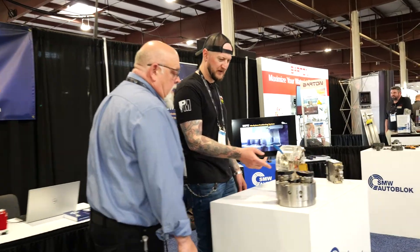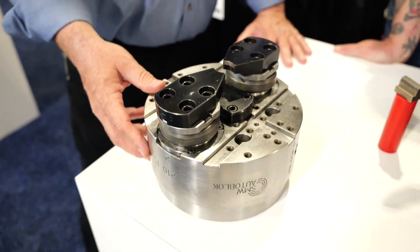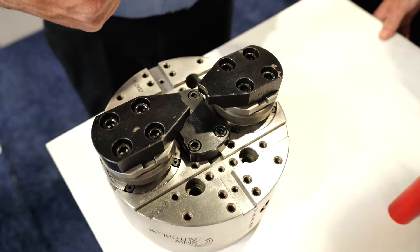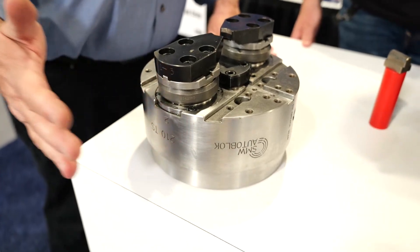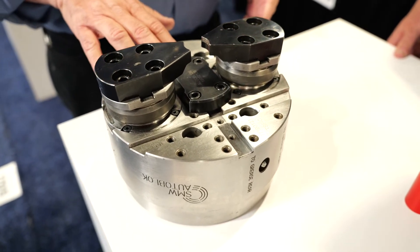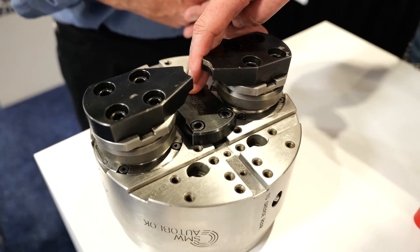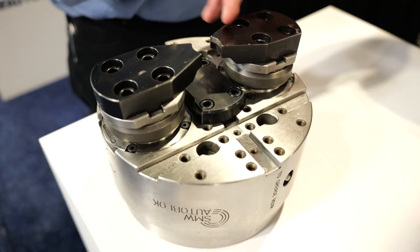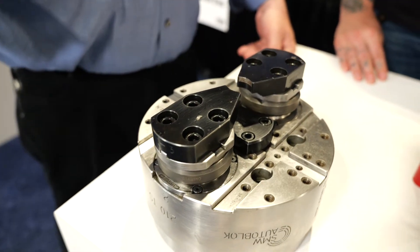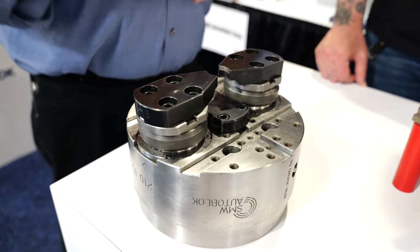What am I looking at that's on a chuck like this? This is a two-jaw TS chuck. We sell them in two-jaw, three-jaw, and also six-jaw. This is a pull-down chuck — it was developed for a special part that had to be pulled down against the datum. Both these jaws rock in and pull down, and at the last minute pull it against the datum. This is for high production, automotive, shaft work, making air conditioner parts — repetitive work all day long in the same machine. We make different sets of jaws for pulling down the parts in different locators. We can even put a mandrel in the middle for centralizing the part and clamping on the outside. Since you're pulling that down on the datum, this is for work where that length is super critical. Whether it's a center, a firm stop, a locator, air sensing — whatever you need for your automation or mass production. This chuck is for a dedicated part where a machine is going to run the same set of parts or a family of parts nonstop for years, 24 hours a day.